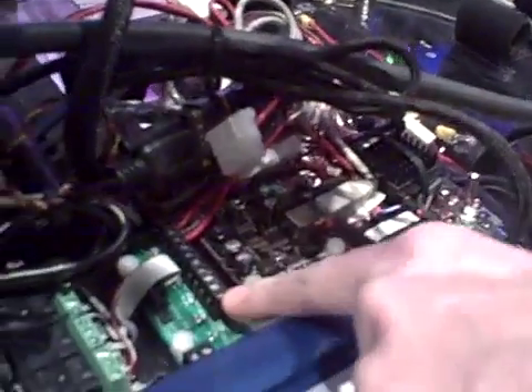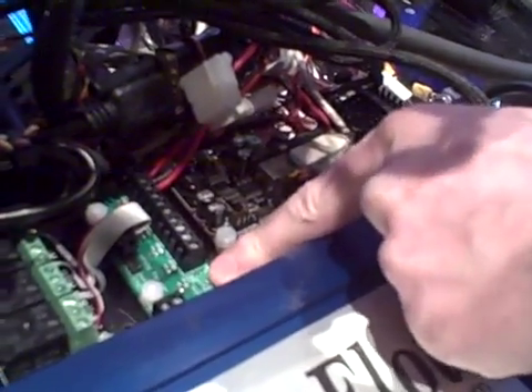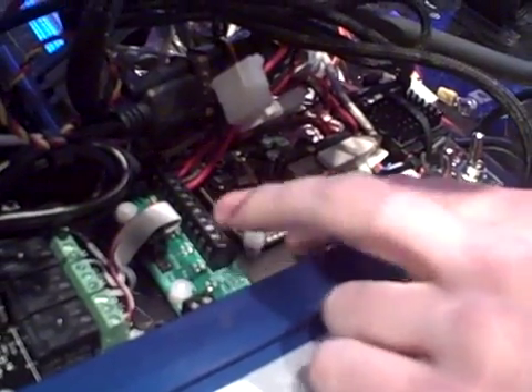Configurability was a huge part. Now, this circuit here is actually me cheating — it's not an off-the-shelf part. As soon as I released the DrinkTender source code, which is my automated bartender, this was a circuit I made to help clean up the wiring for relays. My big problem with relays is you have to do a lot of extra wiring to get them to work and look good, so I made my own little circuit. The entire robot has four 12-volt batteries wired in two 24-volt battery packs. It has motor control, relay control, and a Phidgets servo control.